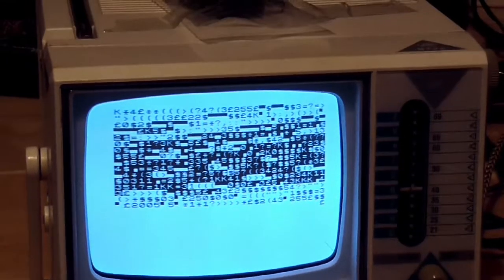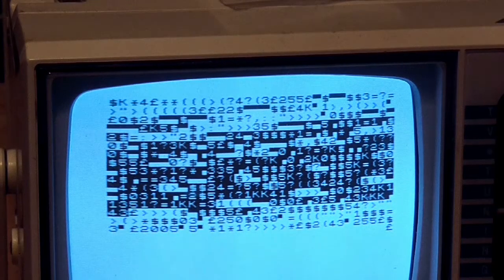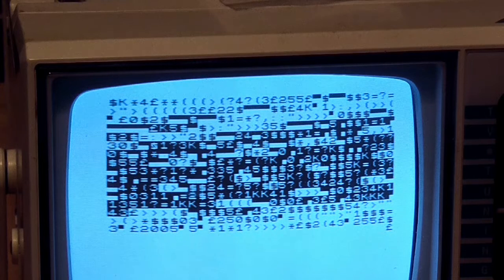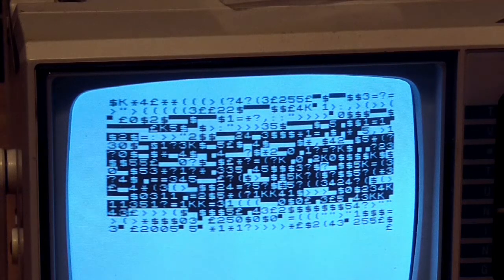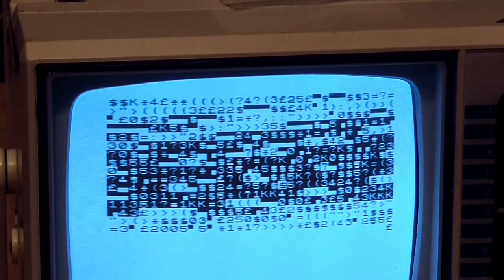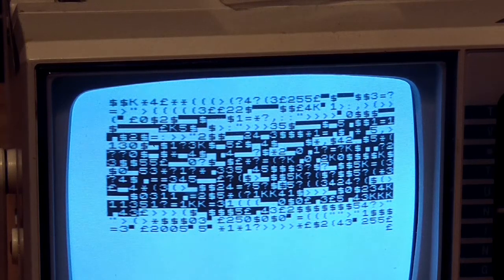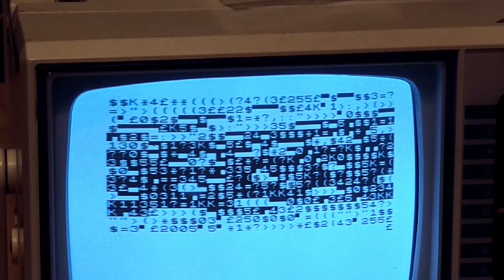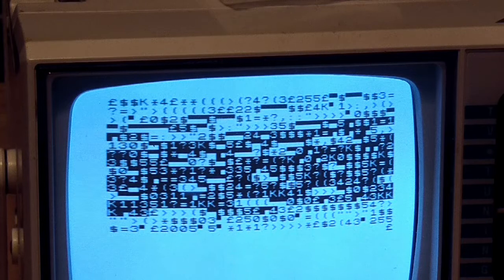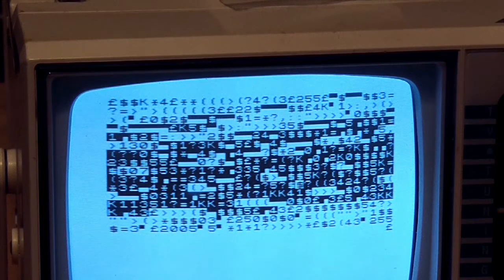So the clip that you can see playing at the moment is the ZX81 sending out its I/O requests on port 4, and the Pico is responding by sending back a predetermined sequence of characters, bytes I suppose, that represent characters on the ZX81. It was meant to be a photograph of Einstein, but something got lost in the translation.